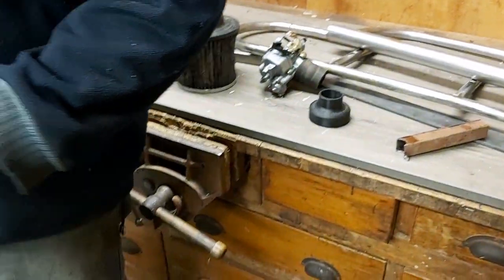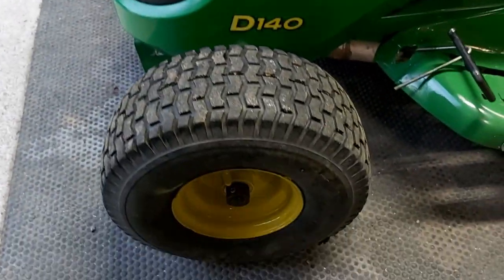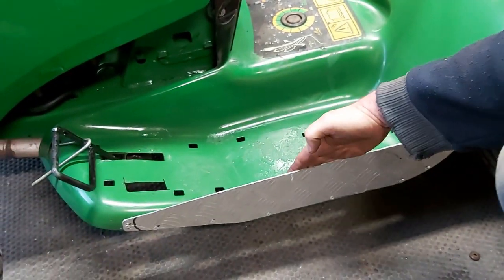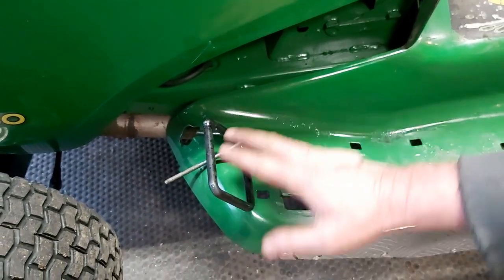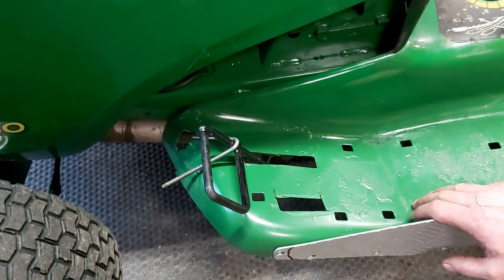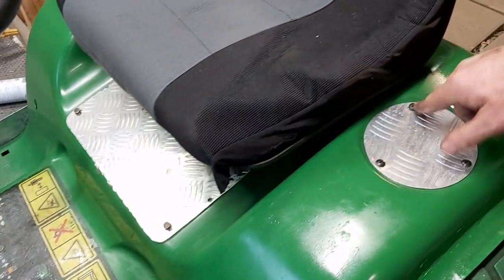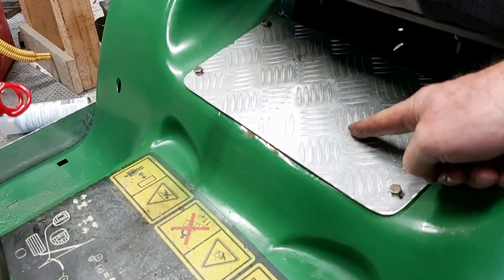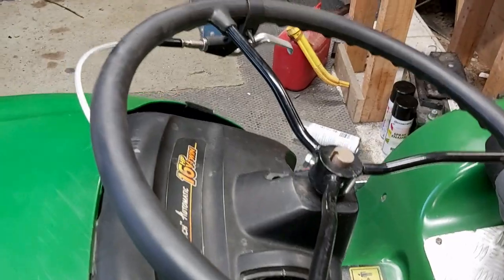Having a look at the mower, we've had a bit of fun this weekend. We've had the wheels painted yellow — very John Deere-ish, front and rear. We've also put some side panels on here to stop your feet from sliding off the side. With the pedals we've done a bit of a modification — they weren't quite strong enough so we've cut them and welded them at each end, much stronger. We've adjusted the clutch and the rear ones are all done, painted up nice and yellow. We've covered over the old fuel tank area with a nice bit of bling, and underneath the seat we've cut a big hole to access the right angle drive below. We've put captive nuts in so you just undo it and the panel comes off for inspection.